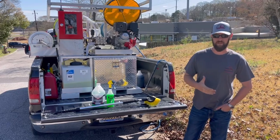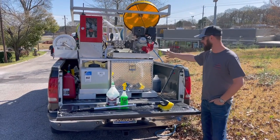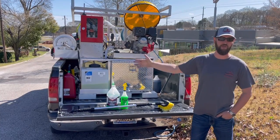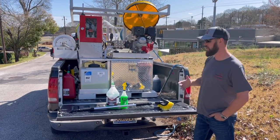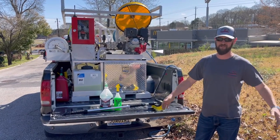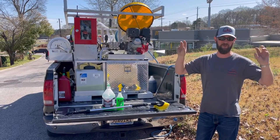Okay, it's pretty basic, guys. What we want to do initially is wet the gutter. Now, I've got enough water in my skid here. We've got our 12-volt system set to just water. We'll be able to just use the truck here and not need any of the customer's water. So we're going to pre-wet those sections. I like to work in small, manageable chunks, you know, 20, 30 foot long sections at a time. So we keep an eye, make sure we don't start etching the paint.